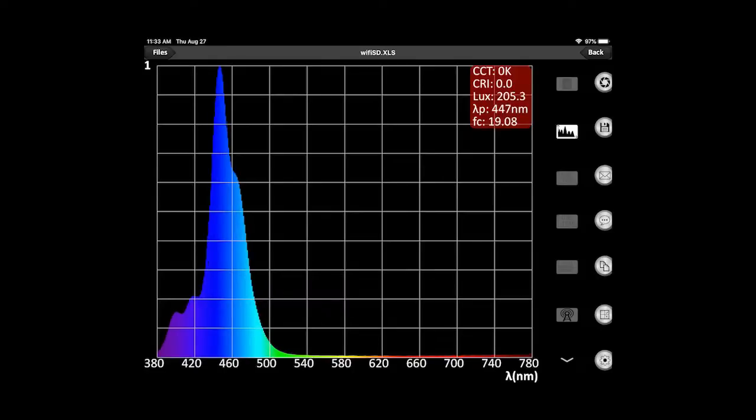So when I say shifting the ratio, I mean this one is mixing a bunch of different blue LEDs, obviously. Right? And so when you turn it down, it's probably not scaling them absolutely perfectly. And that's probably what you're seeing in this case. Yep. So I don't know. But that might be the PWM one here that is just doing it a little bit better, especially in a more complex scenario with more LEDs. It's the one with the digital face, which makes me believe that it's PWM. I don't know for sure. Yeah. All right, next one.